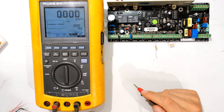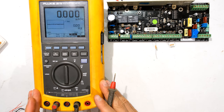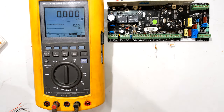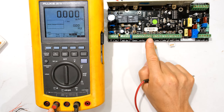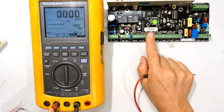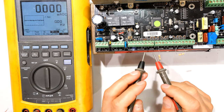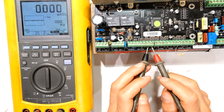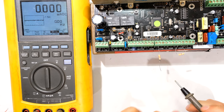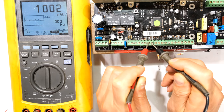The next step in testing the zones is to measure the current. I know many people do not have an ammeter, but I'll demonstrate this test anyway. I've connected the meter terminals to measure current and set it to DC milliamps. The current coming out of the zone is very little — on this particular alarm it's only 1 milliamp. I want to test that each zone is outputting the same current. I put one lead on the zone and the other on the negative, basically shorting it with the ammeter to measure the maximum current from the zone.